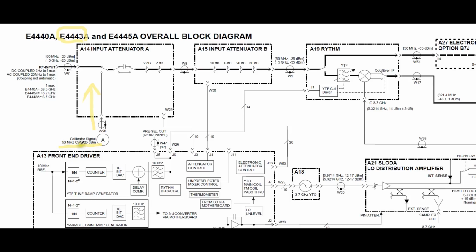Now this is a nice thing to do because it means that you're able to actually fully characterize the attenuators all the way through here. The attenuator steps can all be characterized, and this is critical if you want to make sure the attenuators are there and the steps are consistent, and if anything happens you can detect them.